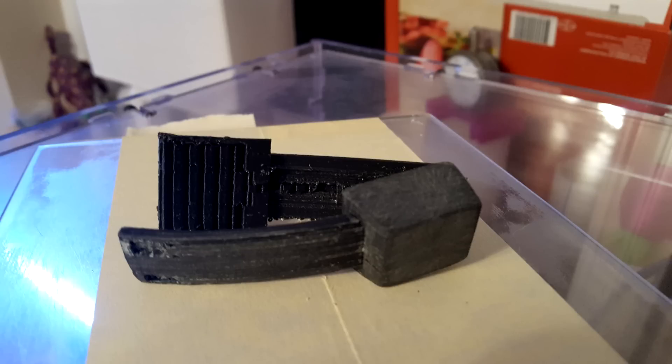The use of supports is also necessary and it adds to the cleanup time of the part. I ended up printing a pair at two high temperatures wanting to make sure I had a strong part, and it ended up being trashed — an unusable part. It was just too much cleaning and sanding, the supports were too tough to get off, and the surface underneath was not looking very good.